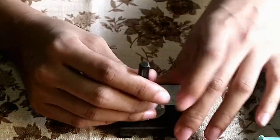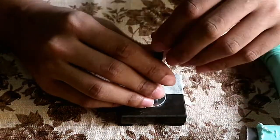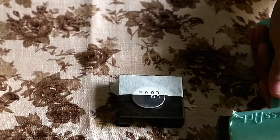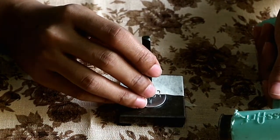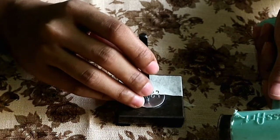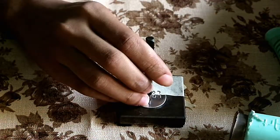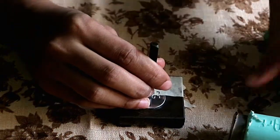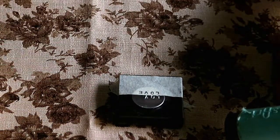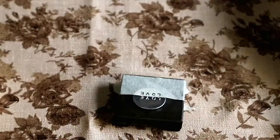It's a bit loud! And then as for the second letter, letter O, I'm gonna do the two consecutive technique. Use whichever technique you're more comfortable with, but one big blow is advisable. You can feel the edge of the letter stamp touching the top of the masking tape — that's how you know your letters are aligned. Letter E next.